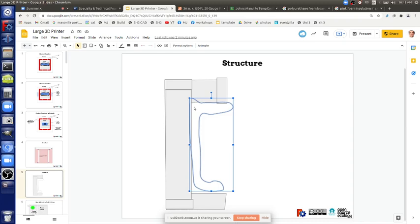So we make this frame with standard construction, and then do this internal layer. We can do it with regular board insulation, but this works. This addresses the insulation value and it has a structure. And where would you put the mesh? Inside, and then the insulation on top of it, and then maybe another layer of chicken wire, or just wire zigzagging back and forth. Either way. What's cool here is that the carpentry allows you easy geometry. That would be fast. Yeah, super fast. So, could knock it up. Let's do it.